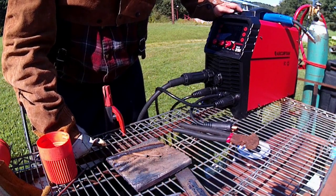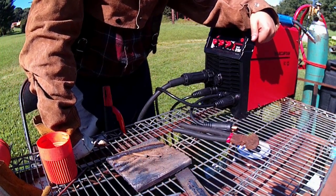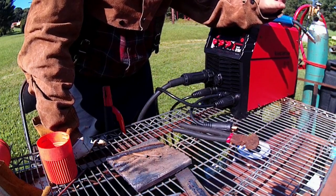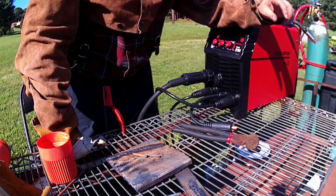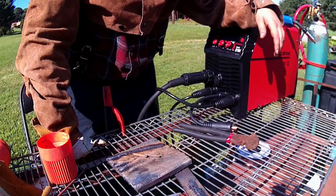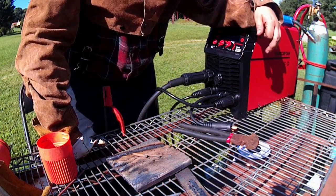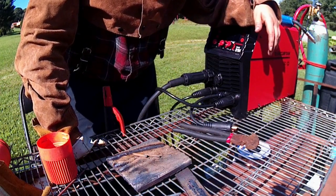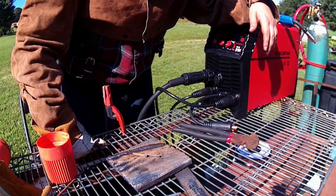So it did well. Like I said, the Mig. Looking back after I swapped out the rolls, I did notice a little bit of back and forth play with the spool mount, but I tightened up that spot after I put it back in, and it fixed up that pulsing issue. So it runs real smooth on the Mig. Stick, couldn't ask for anything better. The flux core works fine. Like I said, I don't use it that much, so that's probably the only time I'm going to run it on this thing.